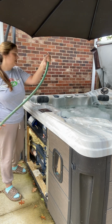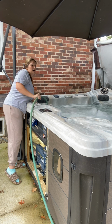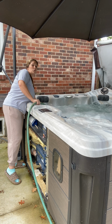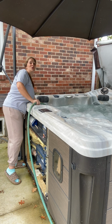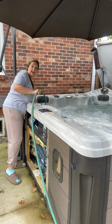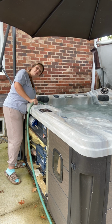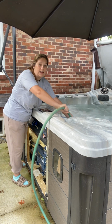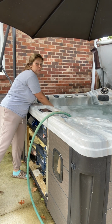Take your water hose, you're gonna hold it up to your jet. So, holding it up to my jet, we're gonna give it just a minute. When you start it and you feel the water, I feel the warm water going through the hose with my right hand here. So I know the water's coming out on the other end. So you want to leave this end that's in the water. As long as you leave that in the water, it will keep siphoning, no problem.